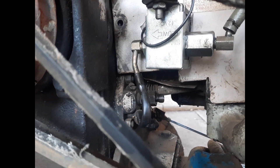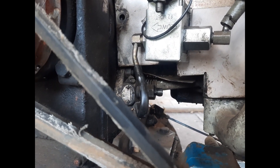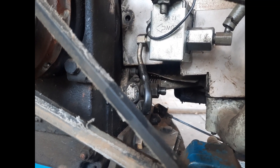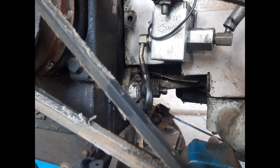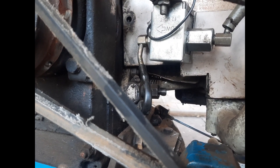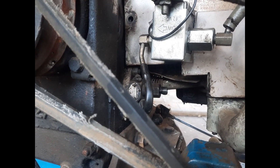I have a half a mind to bypass this electrical pump, which is not supposed to be in here anyway. As far as I know, there should have been some sort of inline filter or glass bowl, sediment bowl, and a shut-off valve — that all seems to have been removed. Doesn't seem to be water in the diesel as far as I can tell. I don't want to fill up the tank too much, as there's no shut-off valve and no real way to stop the diesel from just continuing to drip out if we have a leak in the system. So I'm going to quickly look around for some line and see what we can make up.